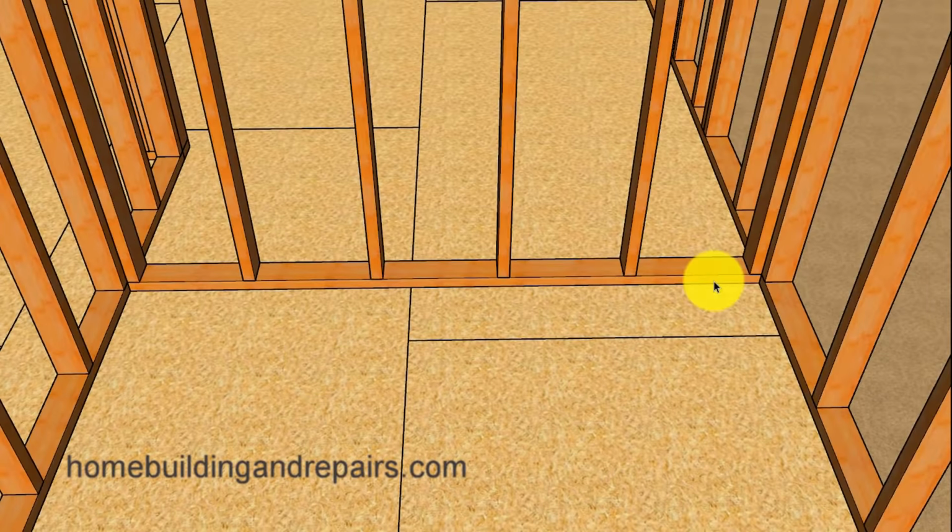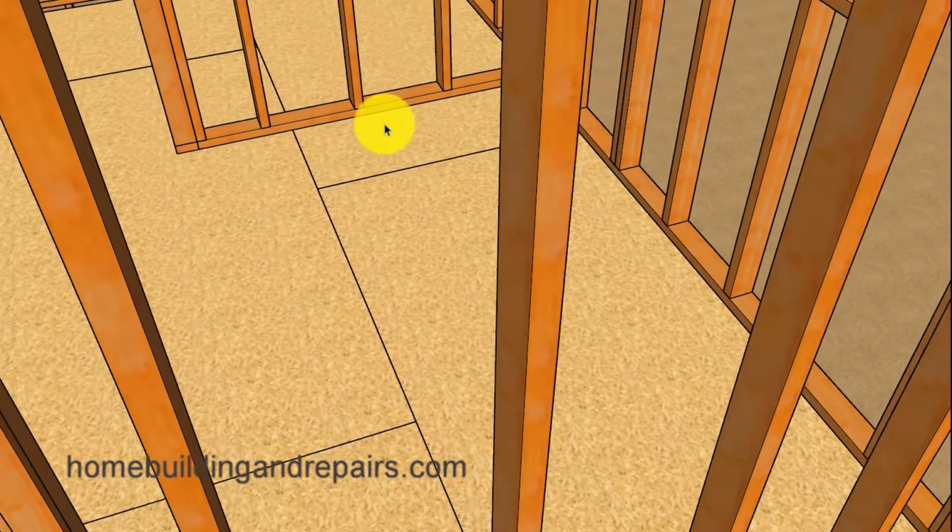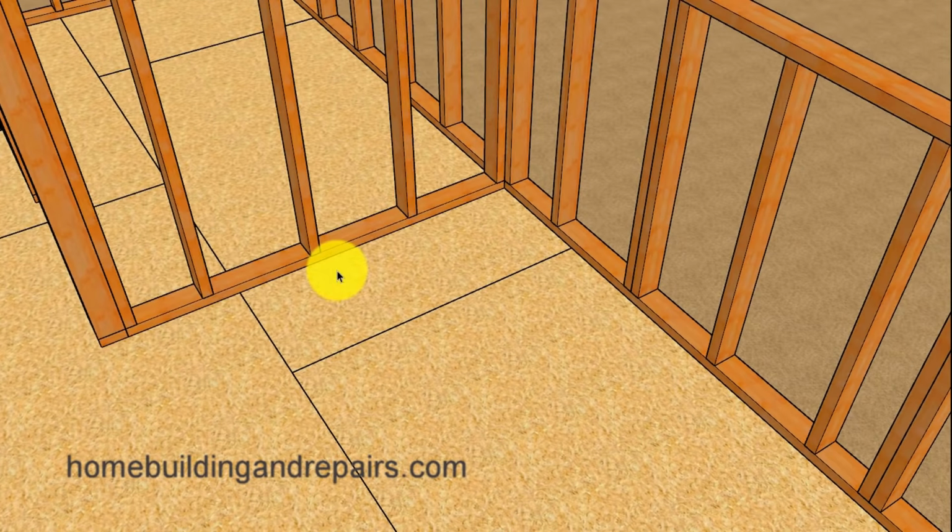And if you're dealing with an uninsulated wall and you need to overspan one of the wall framing studs or even a couple of them, instead of laying everything out at 16 inches on center and then needing to install another stud that's only going to be a couple of inches away from this stud, you could simply leave that framing stud out. And I've done that plenty of times on non-load bearing interior walls.